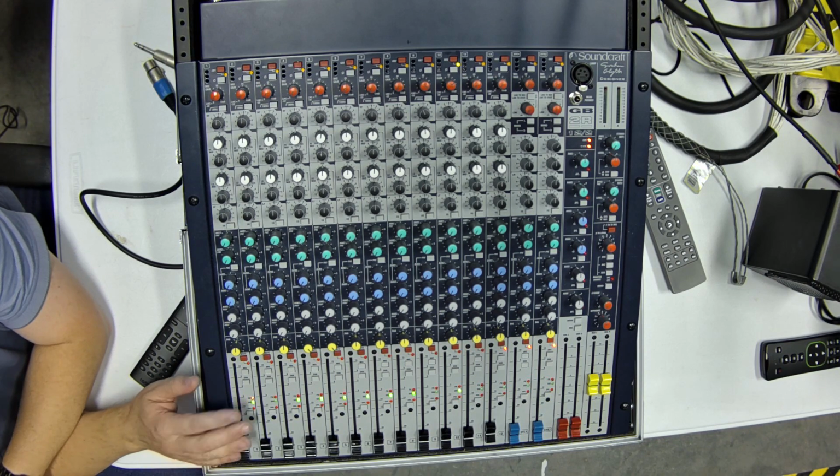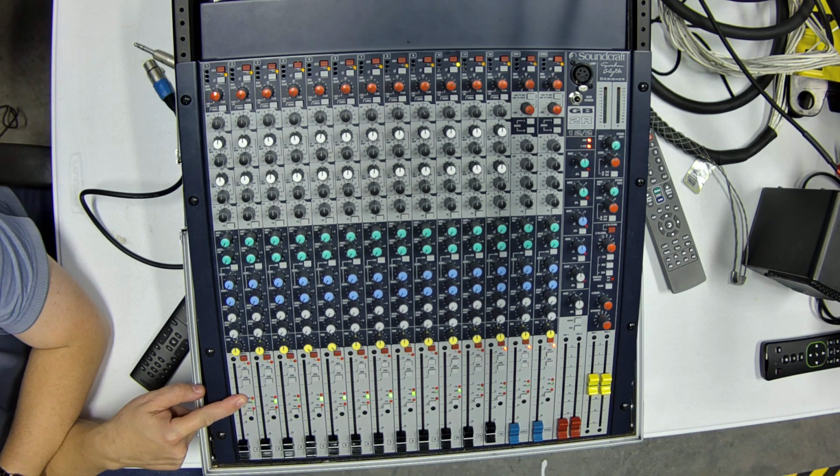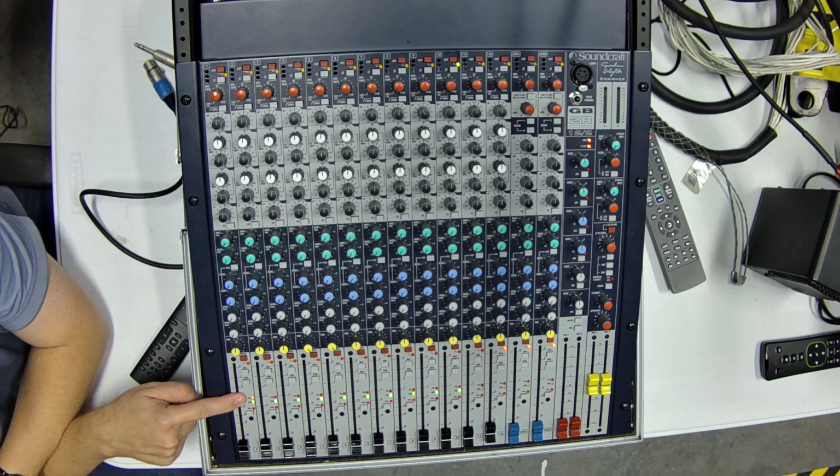So just, you know, heads up. That light sometimes lies to you. Generally speaking, it usually comes on 6 dB before a clip actually occurs. That's generally when most people decide to turn it on, 6 dB before the clip point. How do you know that? Some manufacturers are transparent about this, and they will put that in the manual. They will actually say the clip light turns on 6 dB below the clip. Some don't, but that's how I know, from the ones that tell you.